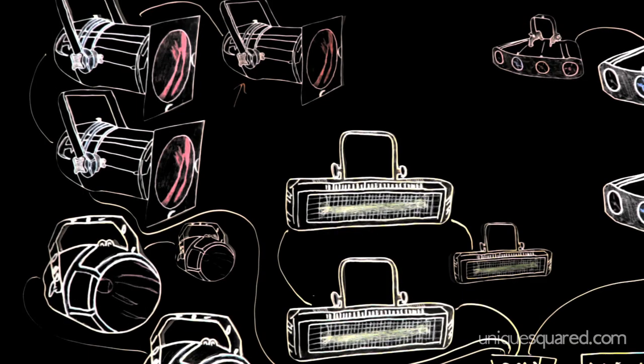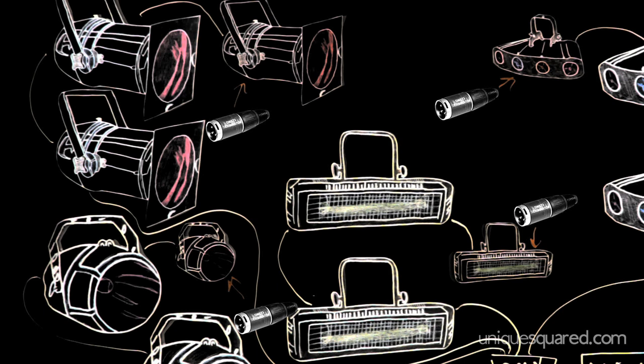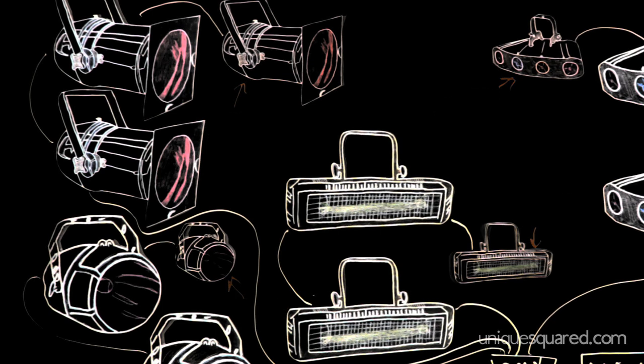It's very important that you put a terminator plug on every single branch coming out of a DMX splitter. If your lights are acting weird and glitchy, you probably forgot a terminator plug somewhere. Some lights have a terminator switch built in so you don't have to insert a plug — you can just flip the switch.